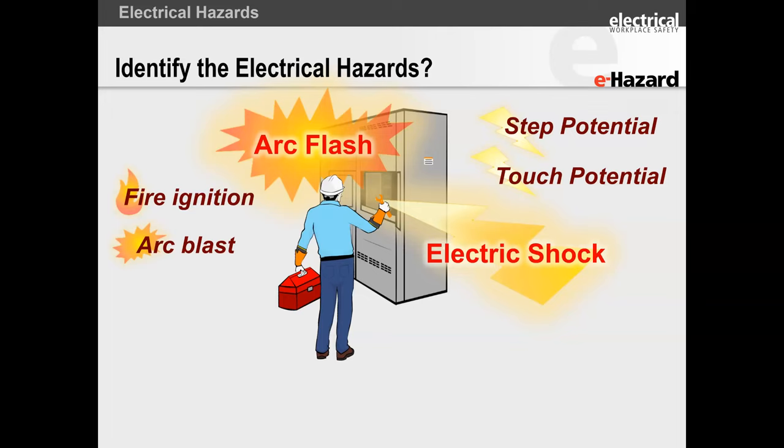Now, electric shock doesn't necessarily mean that you have to touch the electrical panel or the receptacle in your home to receive an electrical shock. No, no, no. In certain instances, we have higher voltages, and once you reach a certain point, that voltage is strong enough to break down air and jump onto your body. When it does that, the air becomes a conductor, you are then connected to the electrical system via that air gap, and you will experience shock.